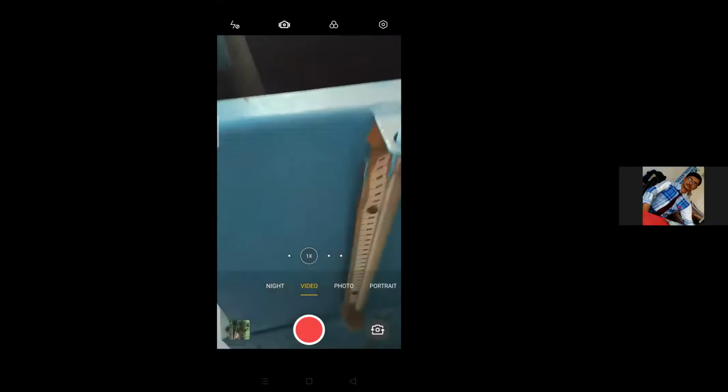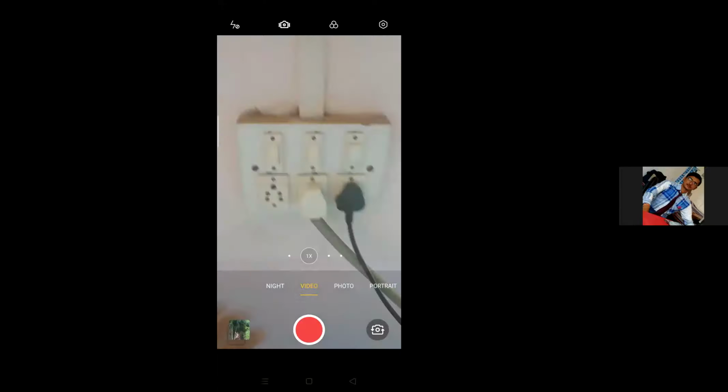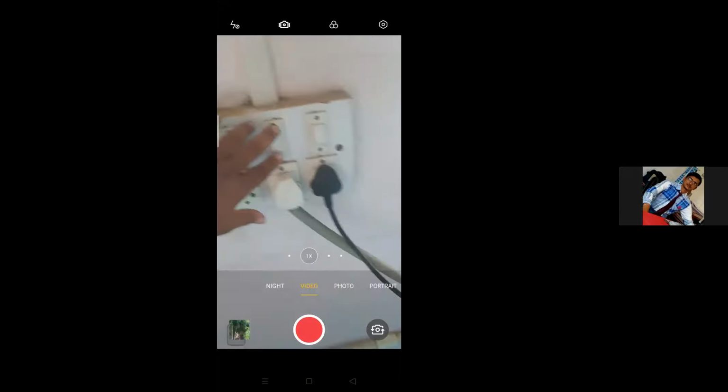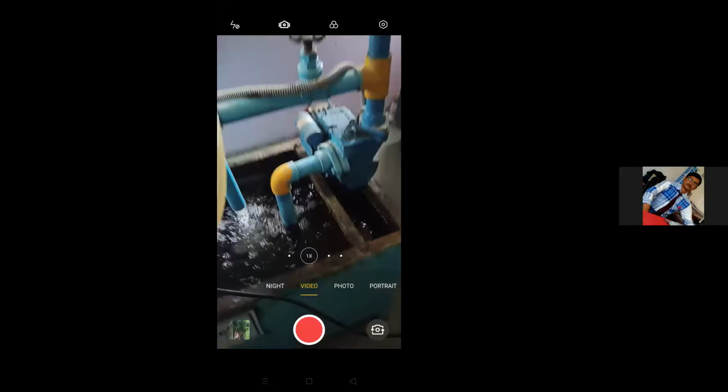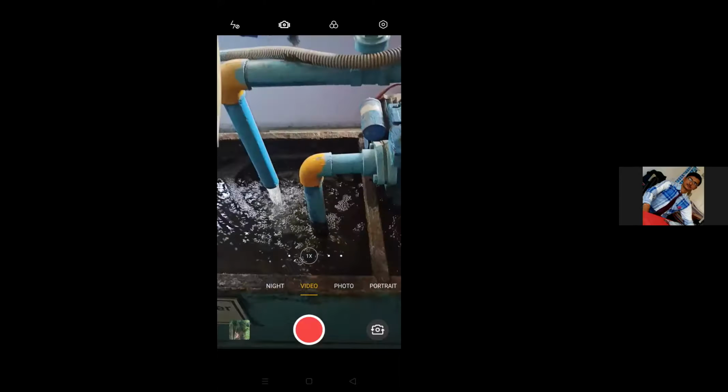This is the measuring tank for measurement of the discharge. We have to take the reading with the help of a stopwatch, and on this differential manometer we will take the reading. These two readings we have to take. Now I am starting the pump. You can observe that the complete water is flowing through this return pipe. Now I am closing this valve.